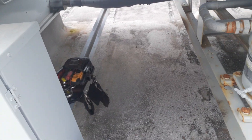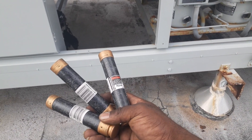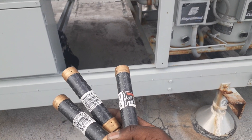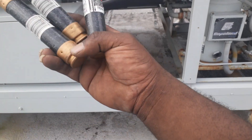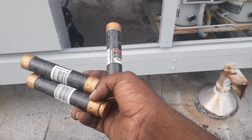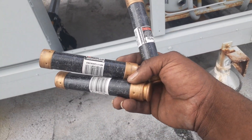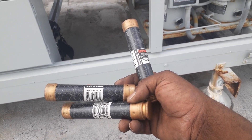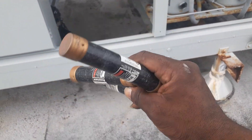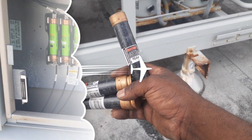I'm going to go ahead and locate these fuses. By it being a 480-volt store, that explains why the main circuit breaker tripped over at the main panel. Normally these fuses would just blow if this was a 208 store, but at 480 volts when you get a short, sometimes it'll bang the main breaker and can even throw off the whole building. With 480-volt stores, always be careful resetting the circuit breaker if you find the breaker tripped.